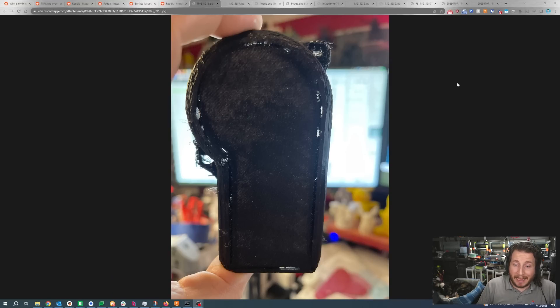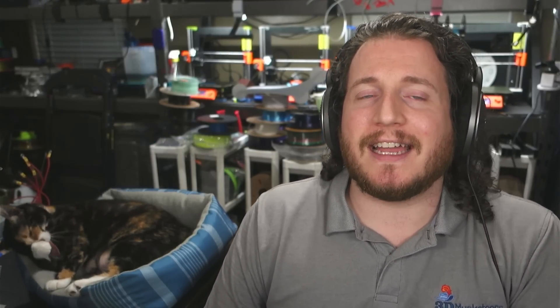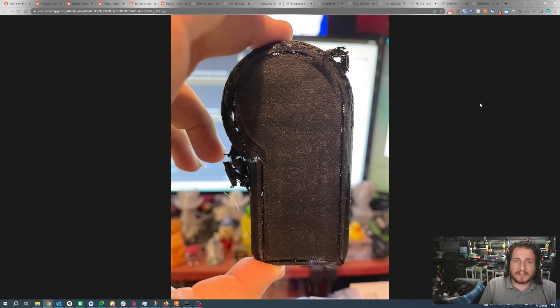Looking at this print, something just ain't right. First off, I said your cooling is not adequate, and that is true because you can tell on the supports themselves they're not properly supported. He needs more cooling. He's running 220°C on the nozzle, 60°C on the bed, utilizing Orca Slicer — a slicer that we'll be taking a look at next week, so get subscribed. The SV06 Plus does have a volcano-style nozzle and heat block, so you can run higher flow rates up near 30 or even 35, which means you can print faster. But if you're not getting your filament adequate cooling, it's going to end up curling like this. With some more photos, it doesn't necessarily get better. I had him adjust settings and it was, in fact, no better — as close to the original image as functionally possible.